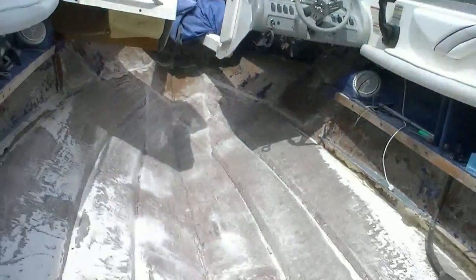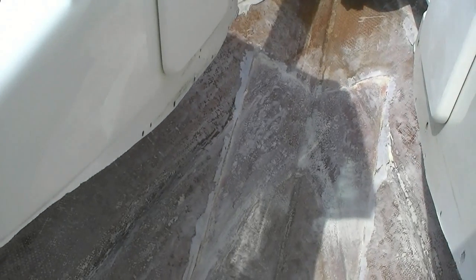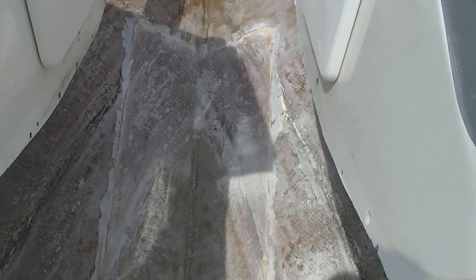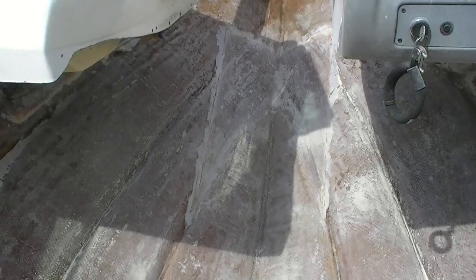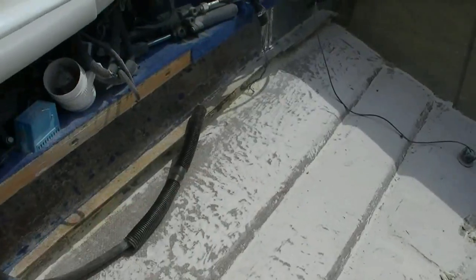I went up here and ground out the front where we cut out those stringers. I took my grinder and ground down real good in the keel section where we need to add that extra fiberglass, and also got rid of the raised areas. I left a little bit of the line there so I can see it, but it's actually flat — that's the filler material that looks just like Bondo where the stringers were, so I can see where I need to lay them down. Look how much dust it creates — just makes a huge mess. The pin-tracing method of keeping the stringer elevated and tracing it worked out pretty good. You still had a lot of adjustment once it was cut because it wasn't exactly perfect, and tracing it to the other side — not so much — we had to do a lot more adjusting. But we got it. We beveled the edges and it's all good to go.